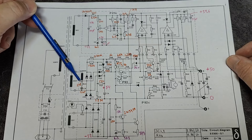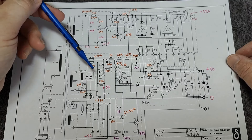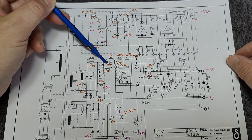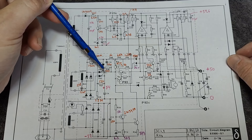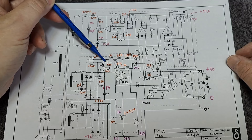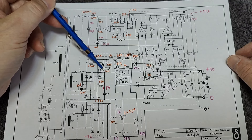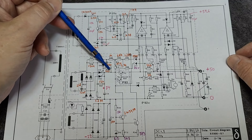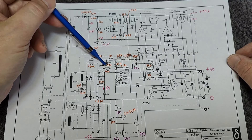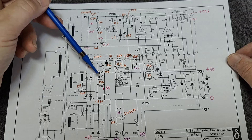You have the inductor here to give you more time — otherwise it's just going to hammer up. There is one little fault in this schematic, and this is exactly why it broke down in the first place. There is a missing resistor in this loop. If you see the 47 nanofarad going all this way — there is no current-limiting component. Only the internal resistance in this capacitor sets the current. Obviously these components can't handle whatever current, so this is exactly how to break it. All you have to do is lift this capacitor and put in a tiny little resistor in series with it. Now you have a controlled, limited current and you will never break any of these components.